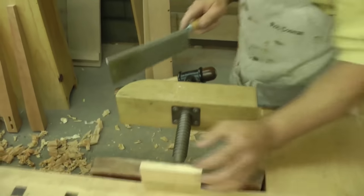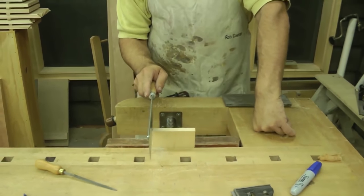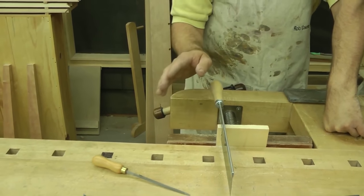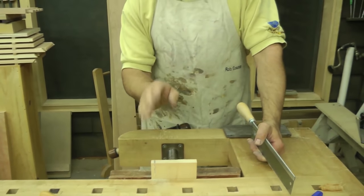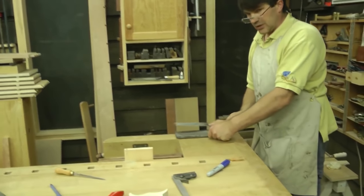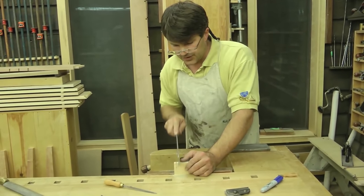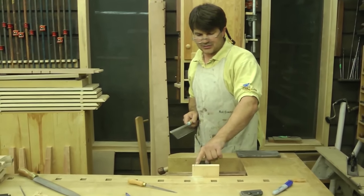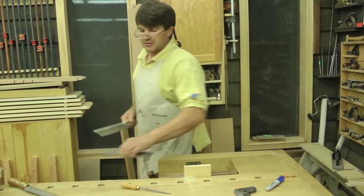After one pass, come over to a piece of wood and make a test cut. I'm watching for two things: how neatly the saw fits in the kerf — I prefer it touching on both sides, no jam and not too much slop — and also that it's cutting straight. If it's drifting to one side, that means the teeth on that side are out too far. You may have to come back and dress just one side, then check again. Make several cuts, especially if you're new at this, to determine and correct any drift.